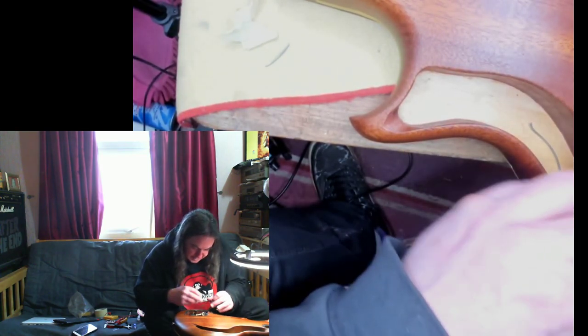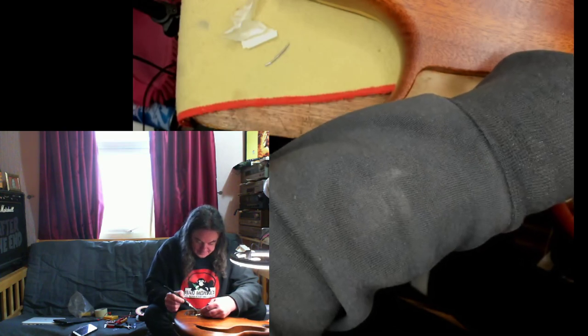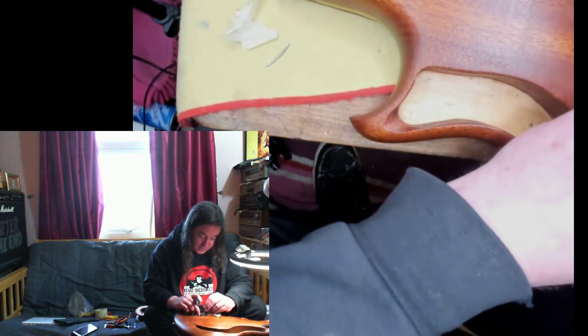Unfortunately I've had to take the strings off this guitar because I had to take the pickups out to try and find out what the crazy mental wires were doing. Some of these things don't look too bad — that's an earth that can just get tucked in there. Those wires are already all connected. That's an earth, that's an earth, that's an earth, that's an earth. There's the earth coming from the bridge — which I'll connect to this pot — not the bridge pickup, the actual bridge itself. So your fingers are earthed when you're playing.